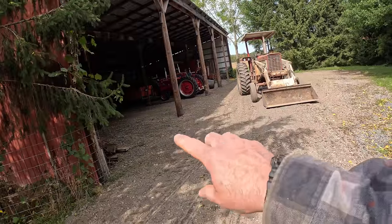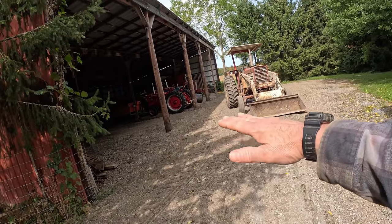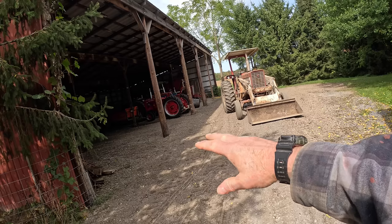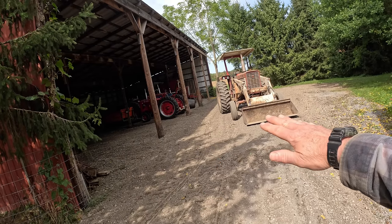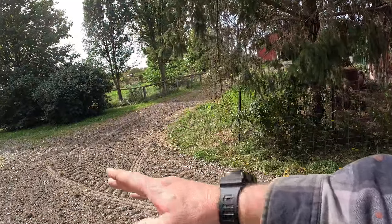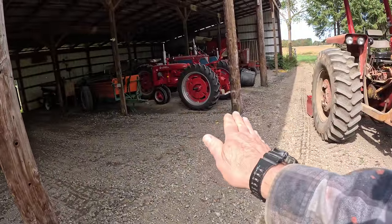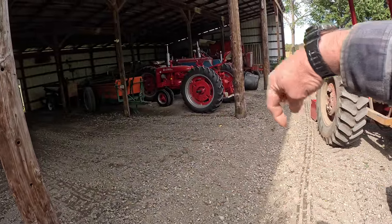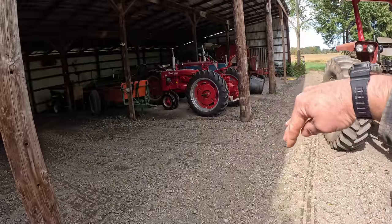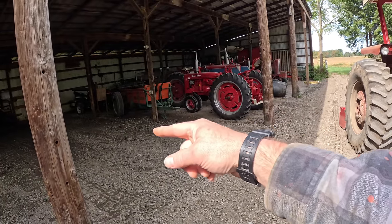I've been working away at this driveway for half an hour or so, and I think I'm almost there. Here at this end of the barn, I had a big hump, and then it's lower at the other end, so I smoothed out, took this hump down probably 6 inches, and kind of pulled it over this way, and some of it I ran around and filled some low spots in this other driveway. And what we got going on here is the driveway slopes down this way, and then kind of the crown is right here, and then it slopes back toward the back side of the barn.